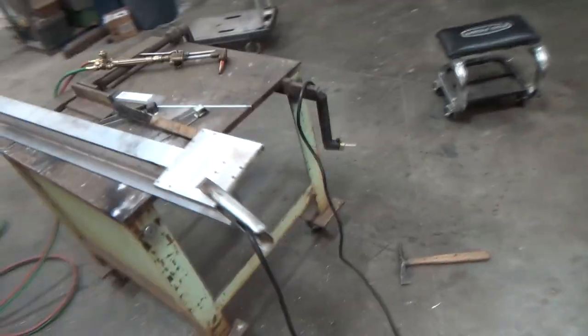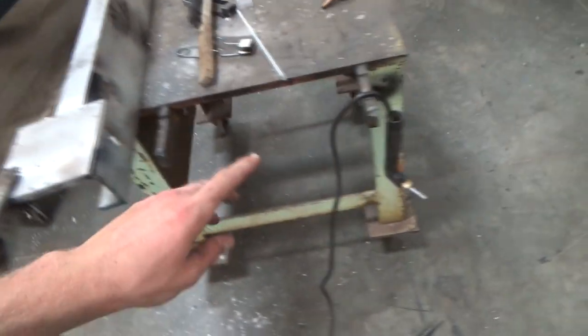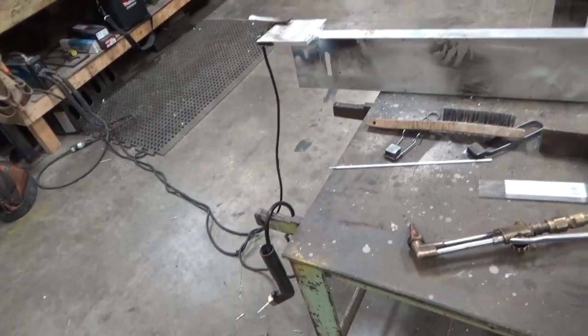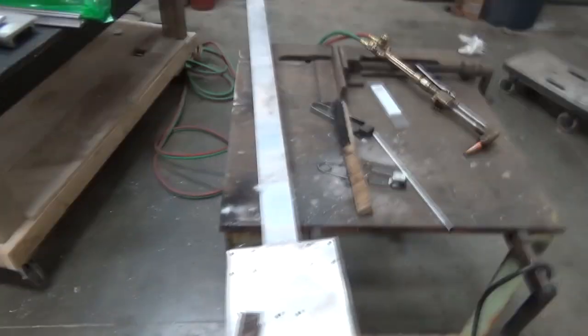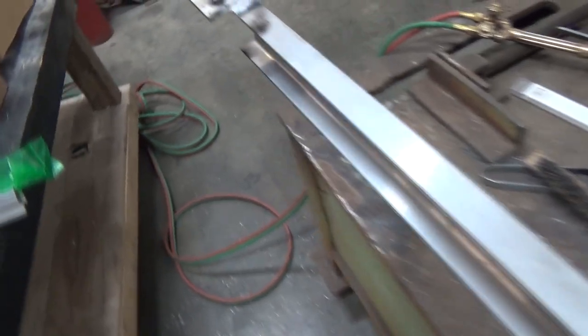Worst welding experience of my whole entire life so far. Never try and stick weld aluminum. It's a shit show. Going in just like regular mild steel welding, nope. Did a little bit of quick internet research, got into the preheating, made sure I'm doing it right. So I think we got it to bond, but it looks like absolute rat shit.